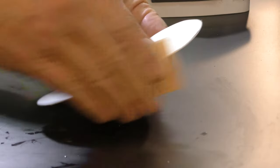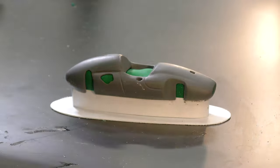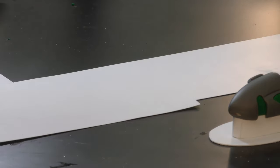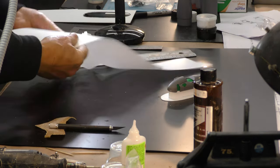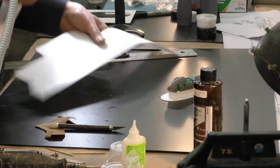I'm going to smooth it out a bit. There we got that — that's about the right size we want. This is a rather stiff material because it's 030, so we're going to use something thinner, like this 05. I want a nice straight edge, so I'm just going to cut off all this excess here. And that's all you have to do — you just score it. Straight edge.